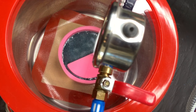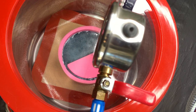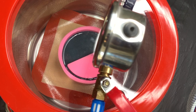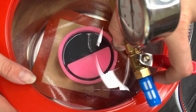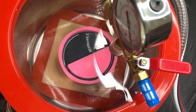I'm going to speed through the bubbles so you can see the repetitiveness of going up and down, releasing air pressure, blow torch, and so on. Once I'm happy with it, if I don't need my vacuum chamber I just leave the project in there because it is a hair-free, dust-free zone. On this very last cycle you can see there are not a bunch of bubbles and it's a consistent, level layer. At that point it would be safe to increase the pressure of the vacuum and have it pull up more bubbles.